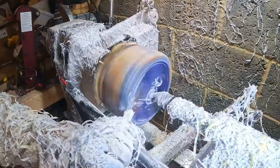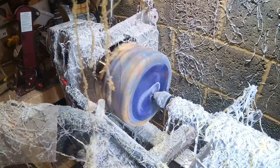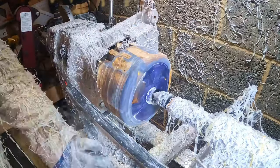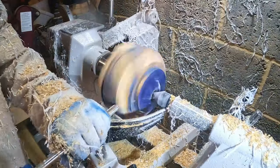The lighter cuts seemed to do the trick and the chipping all but disappeared. At this early stage I wasn't sure how the bowl would look, so I began to form a curve from the base into the side to start putting some shape to it. After stopping to check my progress I could see a few thin pieces of resin that still needed to be removed. I used a 3/8th bowl gouge to start forming the base, but this made the chipping even worse, so I went back to the carbide cutter.